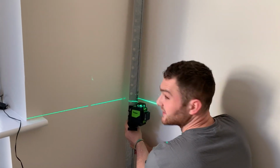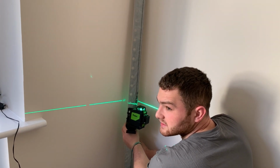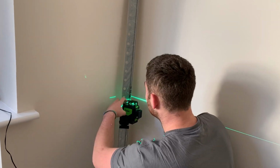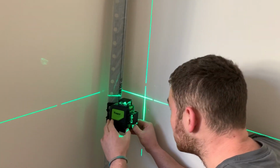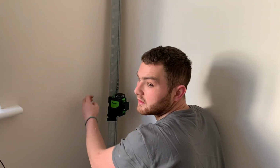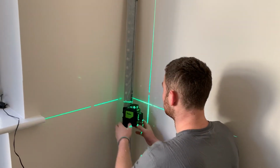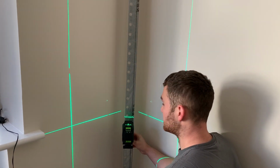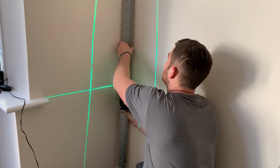It seems to be moving down here, but it doesn't seem to be moving down at all unless I turn it. Well, you've probably got it locked off, so it's not self-leveling. So if you move that switch at the front there, mind your eyes. It's that self-level. The problem it's got, I think, is it's too much on an angle to self-level. So we've got to just get that up to vertical. Tuck that further into the corner at the bottom, and I think we'll be all right.